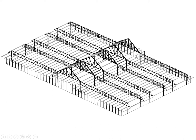In this particular case we've shown a triangular truss that defines a kind of spine through the building, with south and north glazing on each side. It's popped up in triangular form to suggest a centrality and special significance for that portion of the building, expressed by raising it higher.